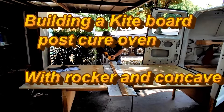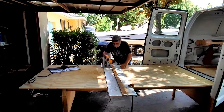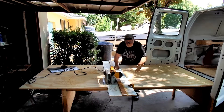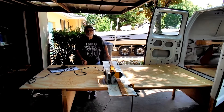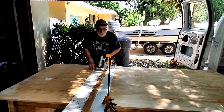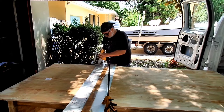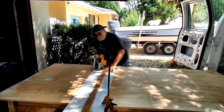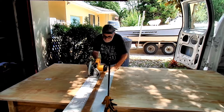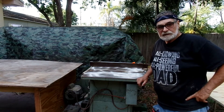We're going to cut our first sheet of 4x8, three-quarter at 57 inches for the rockers. A 57-inch piece will be used for the rockers, and then we're going to use this for the top. The second sheet we have marked off at 69 — that's going to be for the top and the sides of the oven. We're going to cut the plywood up to 8-inch strips by 57 for the rockers.